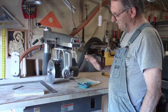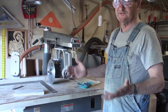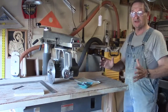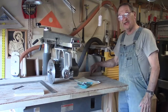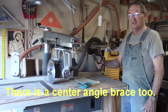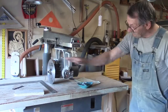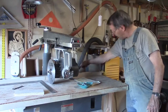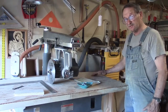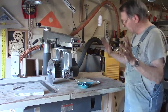I'm going to deal with it the way it is and I'll keep tinkering with these adjustments until I get it within a couple of thousandths of depth for a cross-cut dado. My solution would have been, had I known I was going to have this fight to begin with, I would have drilled the angle iron right below this point and below the same point on the other side of the saw, put in a 5/16ths or a quarter inch bolt, put a slot in the angle iron so I could make the adjustments at this point, and have the pivot points be right there — not way back here, but right here. Then when I got this set and anchored down, this would pivot up and down and it wouldn't change those two adjustments. You could probably get this table adjusted in an hour or a half hour if it was set up that way.